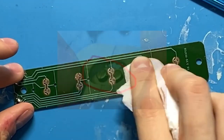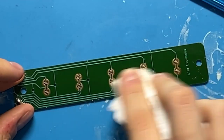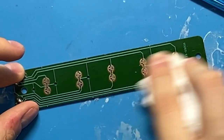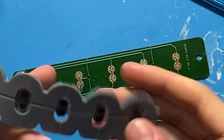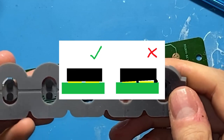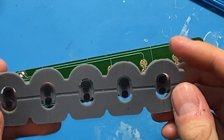This comes from the fret pads themselves flaking off at the edges of the black conductors. You should be doing this every once in a while, as this happens with heavy usage. This can lead to a bad connection, as the excess material might prevent the pad from pressing all the way down and bridging the two halves of the contacts together.